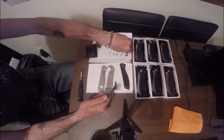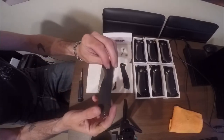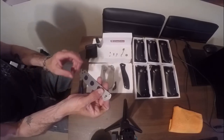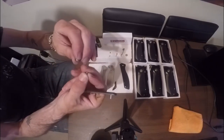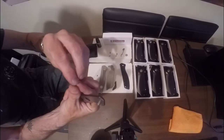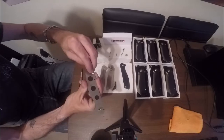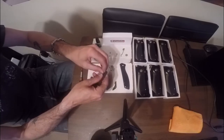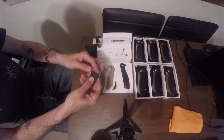Start with the fancy pivot — we're going to do the display side first. I always line up my pivot first. The very next thing I line up on this one is going to be one of the very bottom screws. There's a little bit of old Loctite inside these so I just twist it off my fingers and make sure my screws are nice and clean — blow them out as well. This is your standoff. This blade has two standoffs — one on the very end, which is the one I'm going to line up first — that way my pivot and my rear standoff are all lined up perfectly. Finger tighten for now.